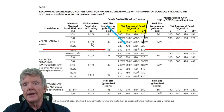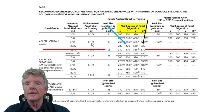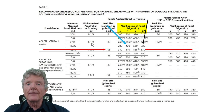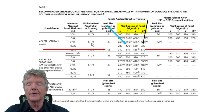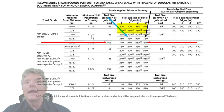When designing a retrofit, you can calculate the required resistance — say 5,500 pounds needs 10 linear feet at 550 pounds per linear foot — or you can maximize strength by nailing at two inches on center for 870 pounds per linear foot. My personal philosophy is to make them as strong as you possibly can. If the earthquake isn't that strong, you're fine; if it's stronger than calculated, you're glad for that safety margin.